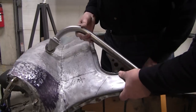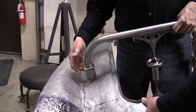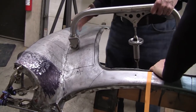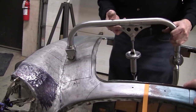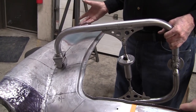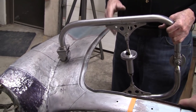And not only that, these yokes are attached by a three-quarter or half-inch thread bolt with a three-quarter head. We can loosen those up and turn this at any angle we want — so we can actually go this way. For this first tool that we made, we opted for about a 12-inch throat, which on this case is all we really need. But we like this so much, we're going to make another one.